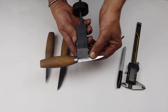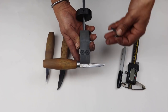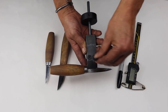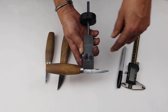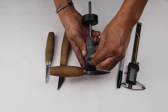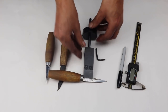We also want to have the blade's spine up against the two registers here so the angle is consistent every time you grind. This jig is really all about consistency so that every time you put it in you're going to grind exactly the same angles and hollows. I'll tighten up using this end of the allen key, just taking up the free play on one side then the other. Tightening sequentially is really useful to even out the stresses on the jaws. I'm not even using the full length of the allen key — it doesn't need a huge amount of force — and the blade is now secure in the jig.